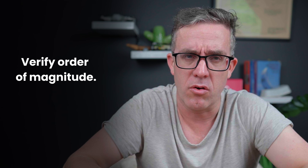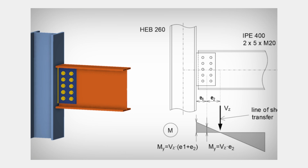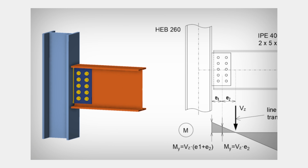Where if you had gone for a full contact connection in FEA, it would have transferred the load all the way back. So when looking at bolted connection designs, it's not just about throwing it into FEA and assuming the results are correct — it's about drilling down to make sure they're actually in the correct order of magnitude. Most of the time you don't even need FEA to get to the right answer, as FEA can hide fundamental errors. Whether it be a base plate on the ground where you're missing the prying actions, or a fin plate with additional bolts adding an unaccounted moment, both can hide fundamental forces you may have overlooked.